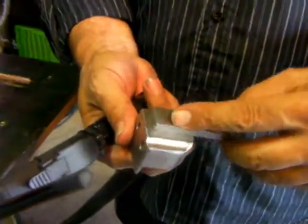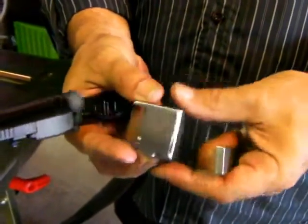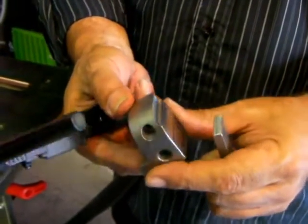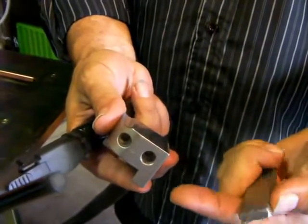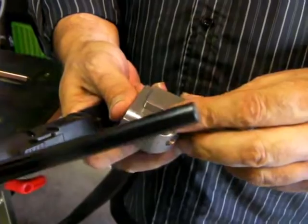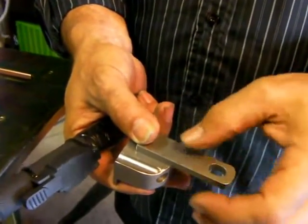These are going to be welded onto these parts just like this. It's not all that complex of a machined part, but it's got a good finish on it, and a machinist doesn't want to do a whole lot more to it when it's done welding. So I want to leave a nice, neat weld. I don't want to melt corners away or chew up anything.